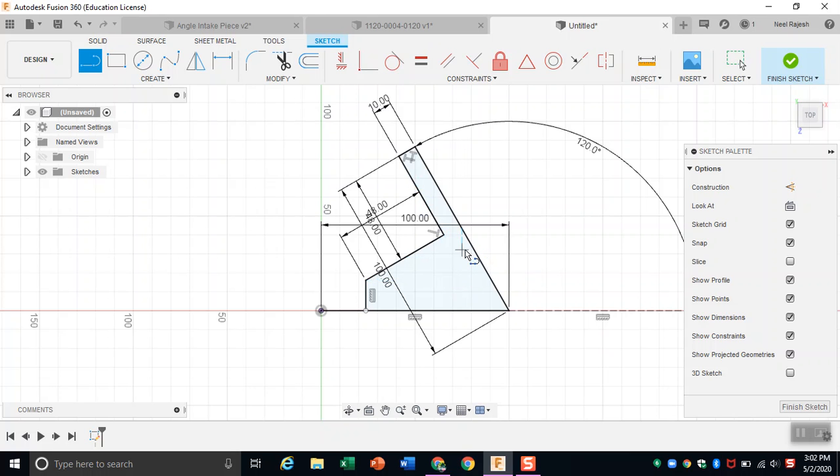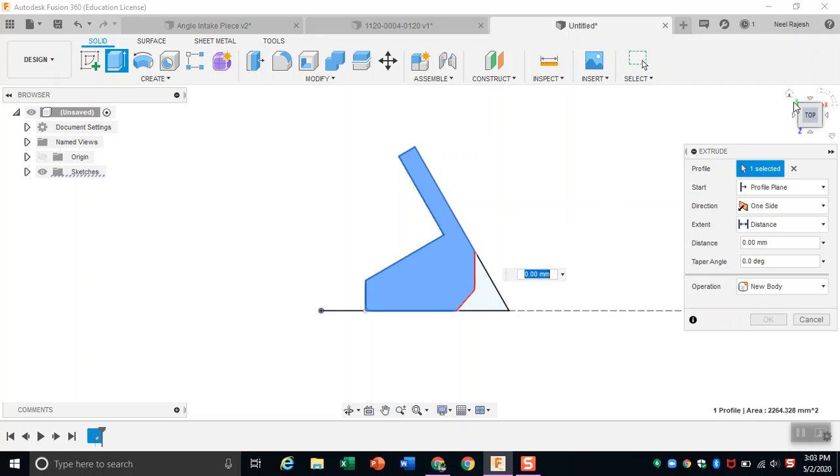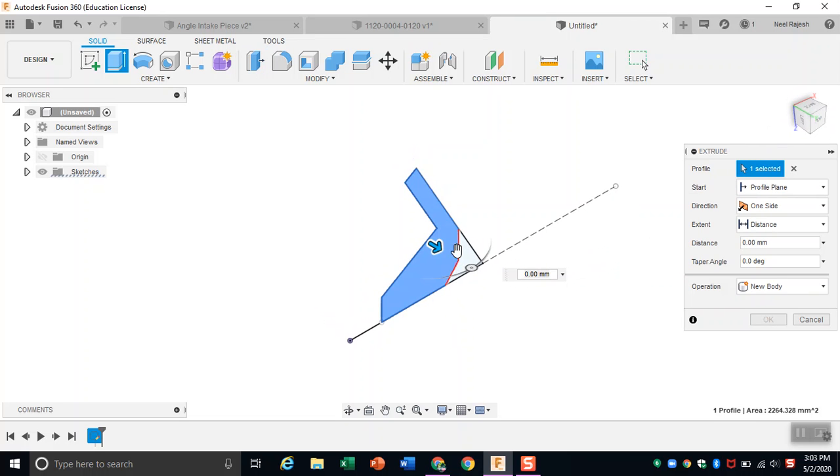We don't want this to be so pointy back here. So we can just cut it off here, and then we can tilt it back some more here. These are all just rough measurements. You don't really need to find anything precise for them, as it's just minimizing the amount of material we need, because this is not necessary for our channel piece. After we're done, we can click finish sketch, and then we can extrude this portion of what we just drew.